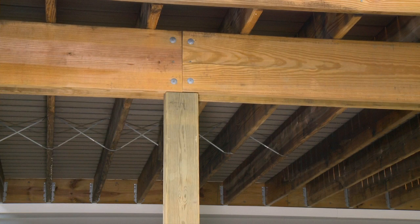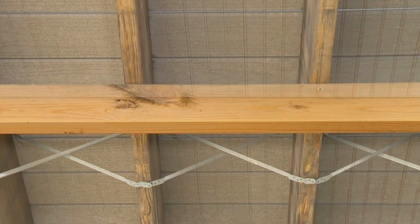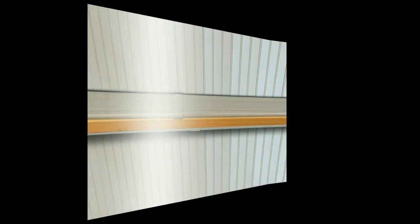UnderShield is designed for a maximum length of 16 feet. For runs longer than 16 feet, a divider board will be required. The divider board will run across the deck, dividing it into 2 sections. The divider board will need to be strong enough to support the attachment of 1 or possibly 2 gutters. We recommend 2x8 pressure-treated lumber.